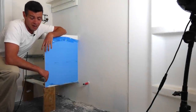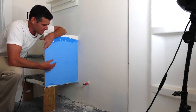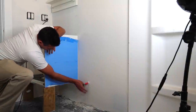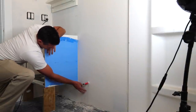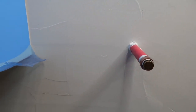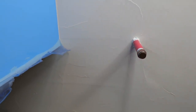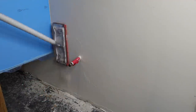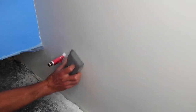This is at about four days to dry, which is exactly how I like it. I love to just leave one-day patches over the weekend — it's had its time to do all its funky quickset stuff. As far as I can tell, it's 100% solid. Let's get more of an up-close look at this. You can see there's the swollen quickset right there and right there — it's had its chance to do its thing. There's plenty of all-purpose mud on there for me to sand it. I don't think this vanity was here last week — oh well, less for me to sand. It looks totally fine. So I guess that answers the question.